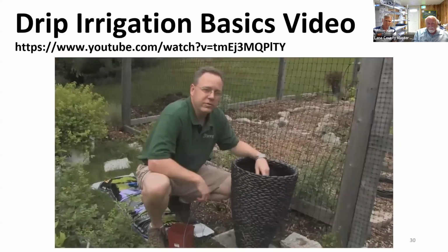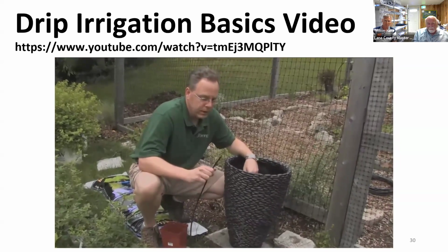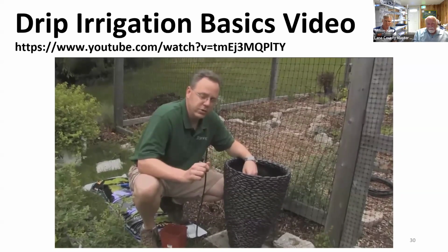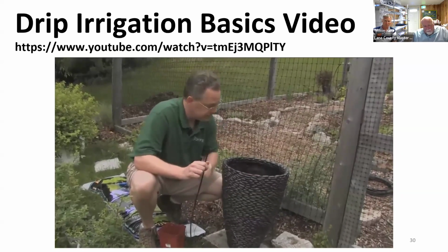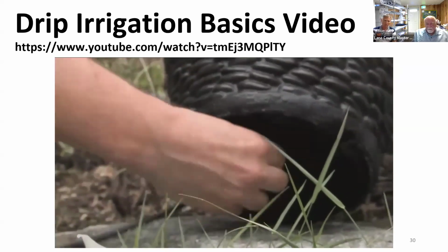There's nothing more tedious to water than your container gardens, and your drip irrigation system can help with that too. What I've done here is taken 1/4 inch tubing that doesn't have emitters in it, attach it to my main line, and I'm going to run it up through the bottom drainage hole in this container.